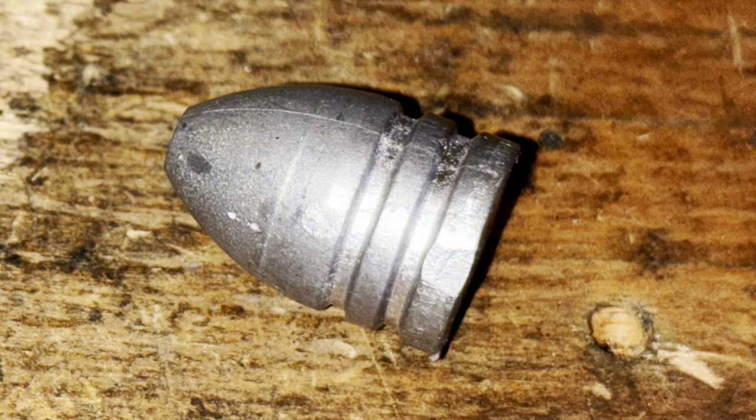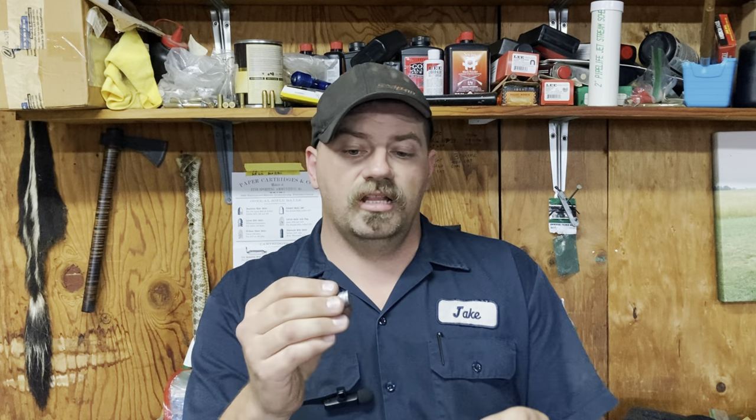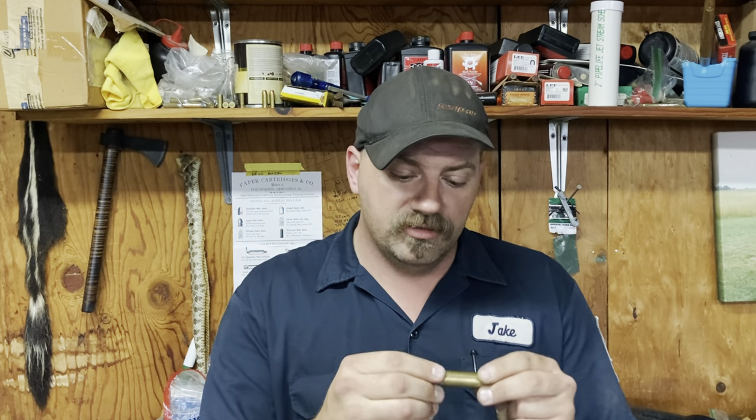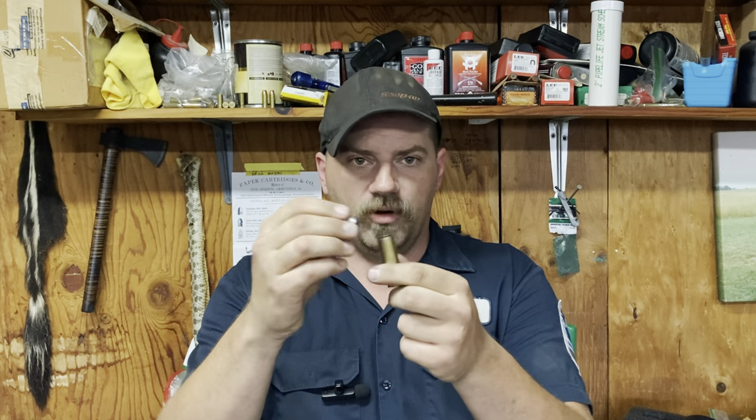I get the best accuracy using a 60-caliber flat-based conical from X-Ring Services — very nice looking. The trouble is you cannot fit this 60-caliber bullet into a case that has just been sized; it's not even close. However, you can fit this 60-caliber projectile into a cartridge that has been once fired. Just a little bit of flare and that thing will go right in there, no problem.